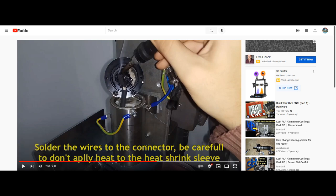Many of you already know that what we're seeing here is completely incorrect when it comes to soldering. Okay? Flux and solder go hand in hand. If you're not using flux, your solder is never going to bond the way it should. It's not designed to bond to itself. The rosin core inside the actual solder is best just to tin the tip of your iron. There is very minimal rosin inside of that solder to make it actually bond. Unless you're doing circuit board work where there are very minimal connections involved, and any guy telling you otherwise, most circuit board work always involves flux. I wouldn't even consider doing anything like what we're seeing now. Like I said, it just keeps getting worse.